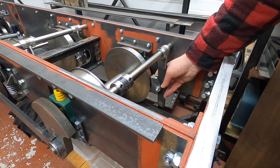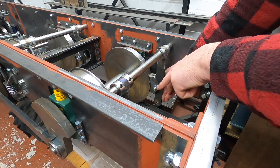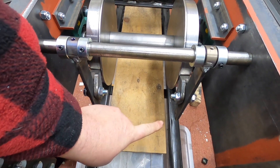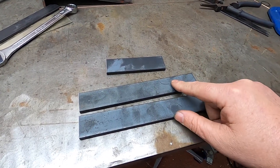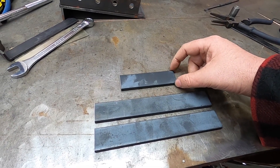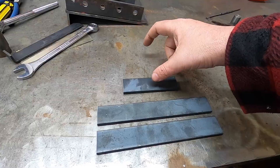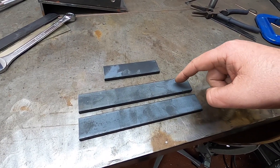Right, so there we go, that's that installed. Obviously it'll sit more like that once we get all the bottom linkage in. We're going to carry on with the brakes — the piece that sits at the bottom of the brake hangers, which keeps them separated the right distance apart and also attaches to all the linkages that goes back to the layer shaft. Cut some pieces of 30 mil by 6 mil — these two are for the pieces at the bottom of the brake hangers, and this piece is the equalizer bar that sits at the back which connects to the layer shaft. I'll tack those two together; I need to just take them down to size and I need to put a slot in.